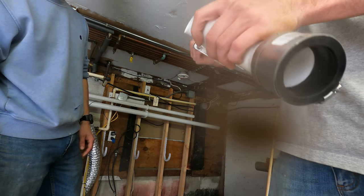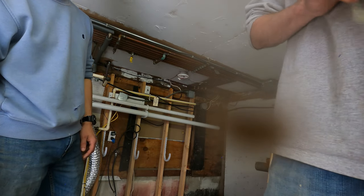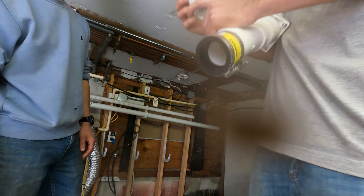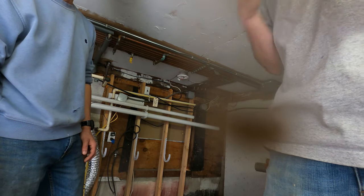I don't want it to back up the vent. So I'm putting this check valve in. But then, doesn't it not vent all the time? There's no vent, so this is what this does. This will allow air in. This will allow air out. Okay, because they both only go one way.